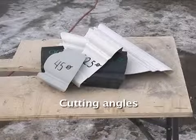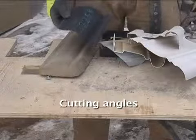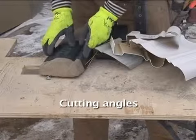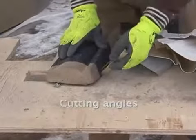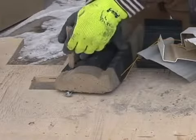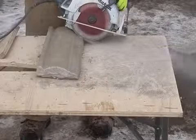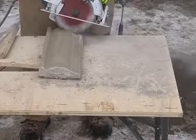Here we show you how you can put the proper pencil marks with a template on a Baroque molding or a sill. These templates are especially helpful if you need to cut 45 or 22.5 degree angles, which you need for inside corners. These templates are not needed for the quirk cuts for outside corners.